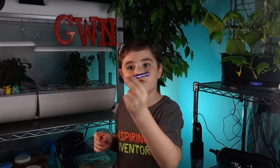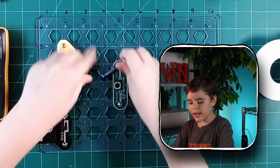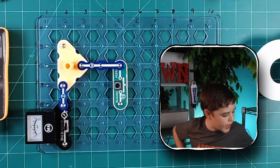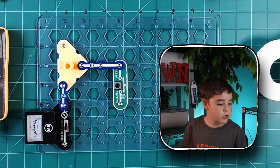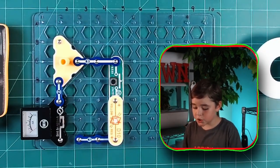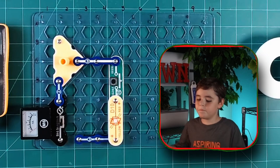Next we have a three-snap wire connecting this point of the pivot stand to the press switch. Then another three-snap wire that goes from G3 to G5. Next we have D10 — this is a yellow-red diode. It is important to make sure that our parts go in the right direction. It says yellow up there, not red — the book says red, so I fixed it.